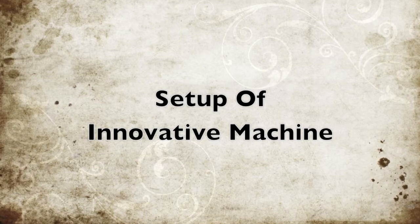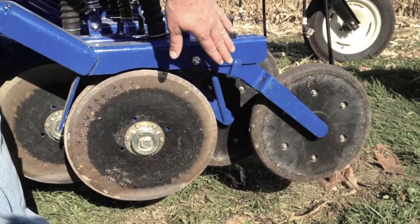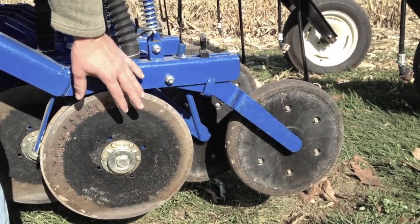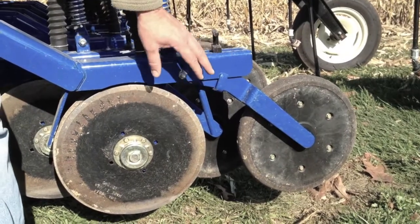The way we're set up, we're configured to operate in 30-inch corn rows or soybean rows. We're also designed specifically for no-till management, however we can work in tilled ground. Basically, we have the units configured to run within the corn rows. Within those 30-inch rows we run three tillage units and a double disc opener and a packing wheel that creates a seed trough, plants the cover crop, and then packs it in.